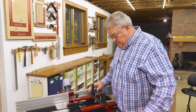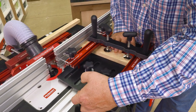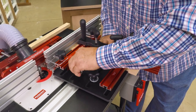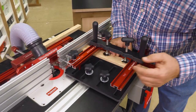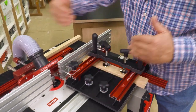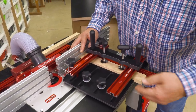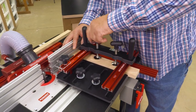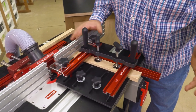Another really great feature of the coping sled is the fact that your stock is captured. We're going to bring that up against our fence, and then I'm going to bring the top plate up against the stock and lock it. When you feed into that router bit, what it's going to try to do is flip the board. No matter how much pressure you have down on it, the forces are still trying to go that way. By capturing it with the top plate, that's the one thing it can't do - it cannot rotate at all. We're going to put a little bit of down pressure on it at the same time, but it's not actually trying to lift it up, it's trying to spin it. Now it can't do either one. We know we've got the cut under control.